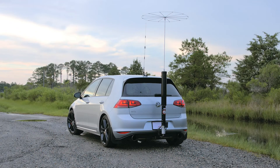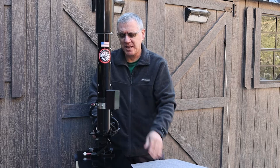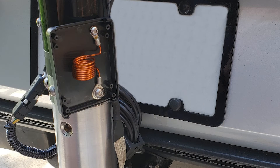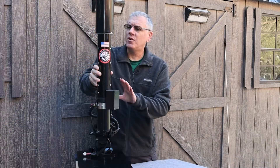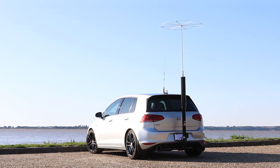I went with the black because it fits in better with the color scheme on my car. This here is its shunt coil — I've opted to encase mine in a box to protect it, because sometimes when grabbing hold of things I had bent up my coil. The antenna is motorized, so this coil moves up and down to make it longer or shorter, and it will tune from 3.5 megahertz up to almost 29 megahertz — in ham radio speak, that's 80 meters up to 10 meters.